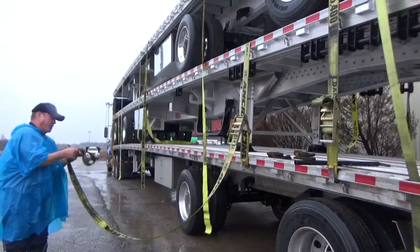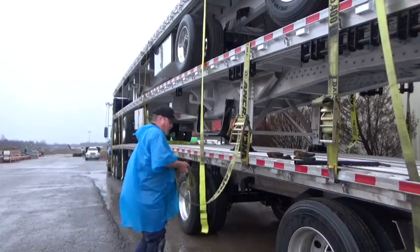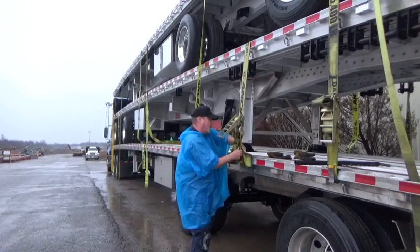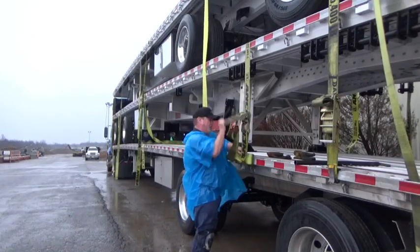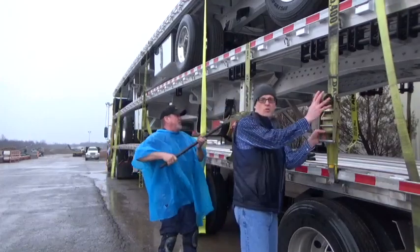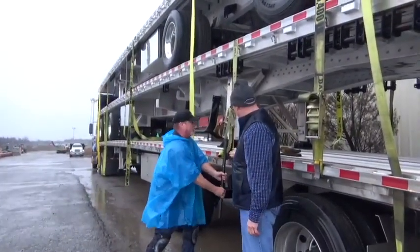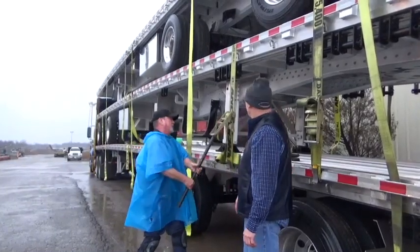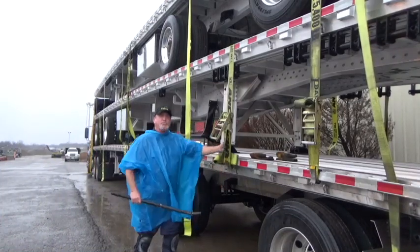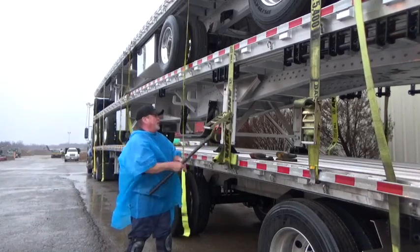There are some little tricks to the trade. Tuck it behind the rub rail while it's still loose — right there. That's one way of securing all that excess. On a smaller amount of excess, Dave did it this route: with a big lot of excess sticking out, he's using the strap to pressure it against the rub rail and it won't move — it'll stay. Because you can't get all that bulk up through there like I did that one, we've got to tuck it behind it.